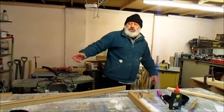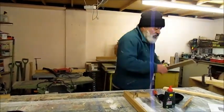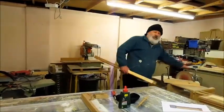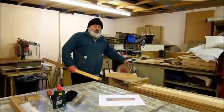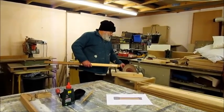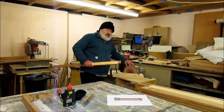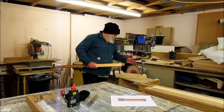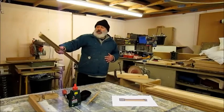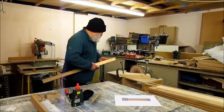What you need then is a linishing wheel like that one over there. I put it on a motor — I took it off an old grinder — and it goes extremely quickly. It's a scary old machine to be honest, but you don't really need the motor on it; put a nice linishing wheel on it and you can just turn it with your hand. I'll just take the last half millimetre off now, because that saw cuts to almost half a millimetre.